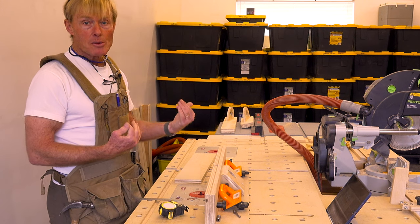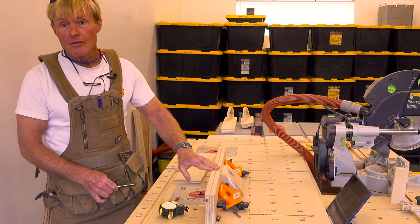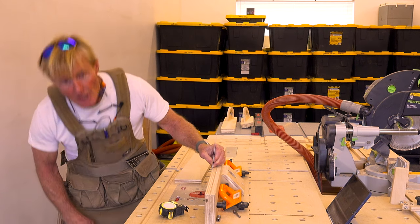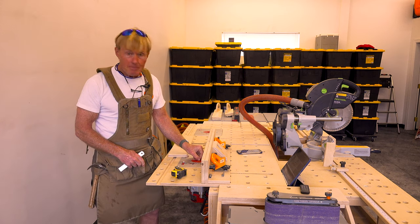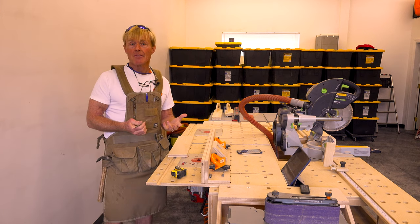This is a variable dimension depending on what your project requires. If I were cutting it for this router fence the way I made it before, that is 25mm, so it will vary. And now I'm going to set the depth of my cutter. This depth that I choose is 10mm, which is less than half an inch.